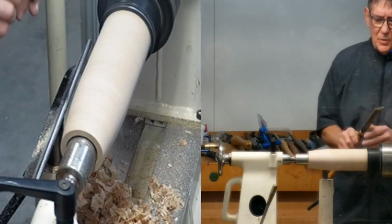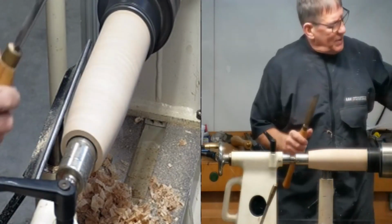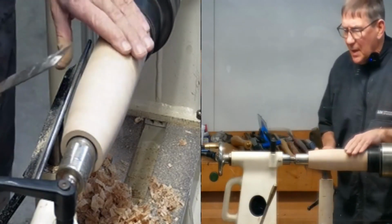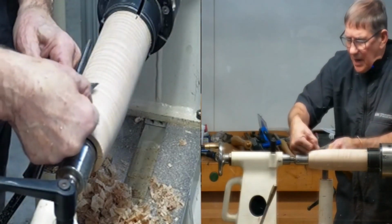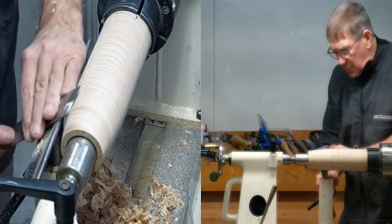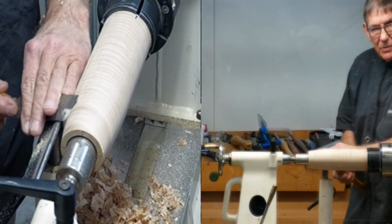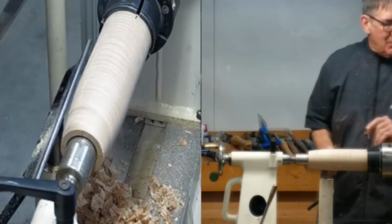Talking about tools for a little bit. Where do we find the cut? Where's our sweet spot in the tool? As we start to look at the witness mark here, I'm at the lower third of the tool. I'm also raising the handle to make the cut. I can't just be stationary in here. This needs to work into that radius.